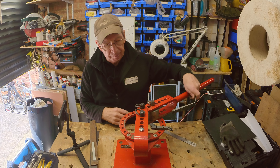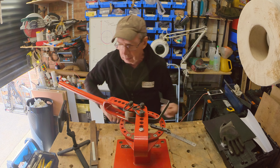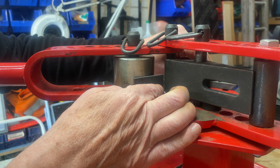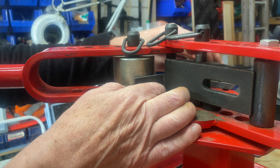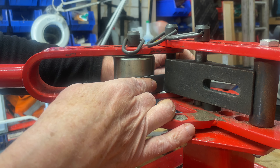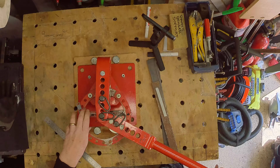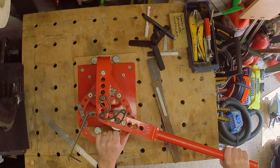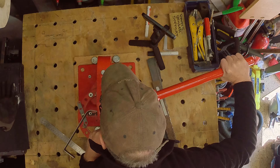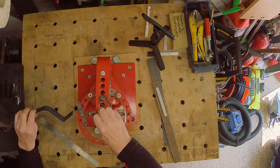There's my mark, two inches from the end of the material. I've got my bender ready and set up. I simply move my mark across until it lines up with the point of the folding attachment — you can just see it lined up there — and then I apply pressure to the arm. About right, and we're all good. Pull the pin out to release it.